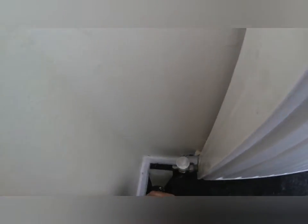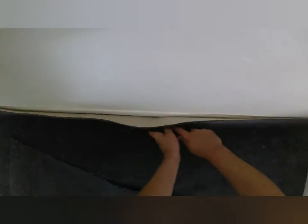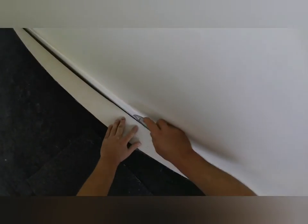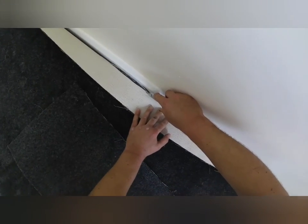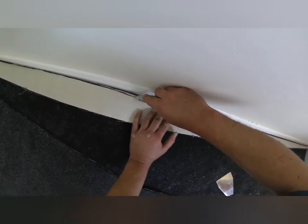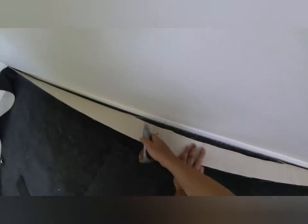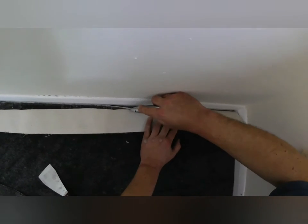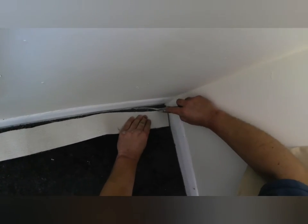I'm just checking before the carpet has been tucked in, and I'm going to do this side. Again very slowly — you can see the edge of the carpet and I'm cutting just a little bit above the edge. Slowly, you can complete the whole thing, and it's not that difficult.